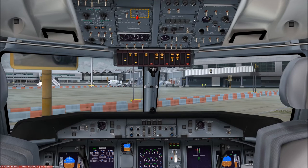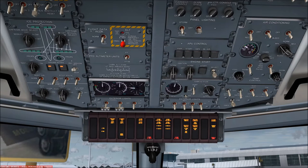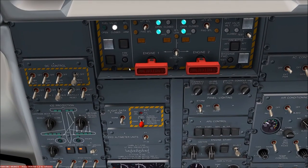The control panel for the Auxiliary Power Unit is very straightforward. It's located here on the overhead panel. To start the Auxiliary Power Unit, the DC APU starter requires either ground power or it can be started from the batteries. Pressing the power push button arms the APU start circuits and opens the fuel shut-off valve, as indicated on the APU fire panel, which is located here.